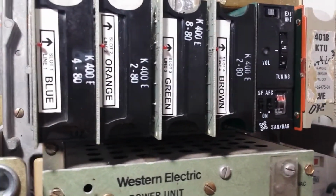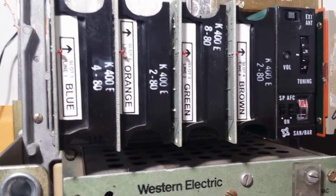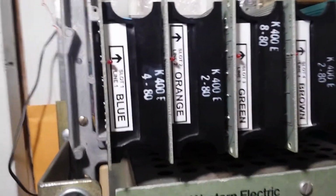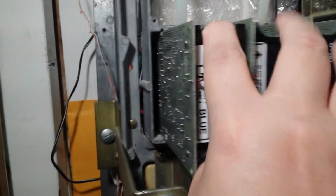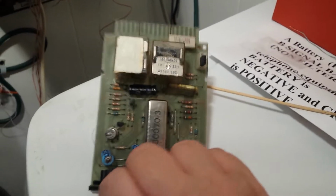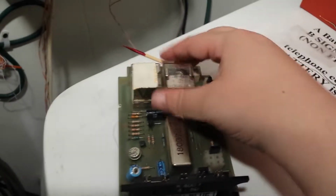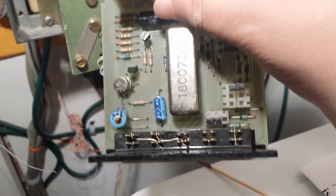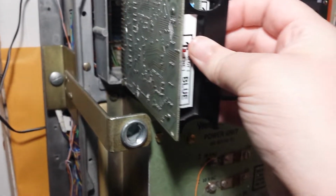And you can have the line cards. There's an option on there. Actually, I'm going to pull it out and show you. By the way, don't ever grab your card and touch it like this, pulling it out, because that is live voltage. Grab it by the handle. There are jumpers on here right there where you can have interrupted ringing by the interrupter or solid ringing, but make sure you do have the practice on that before you do that.